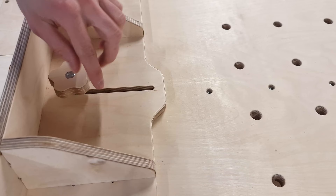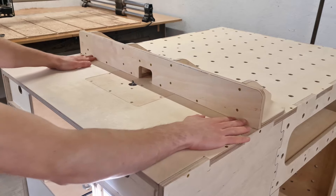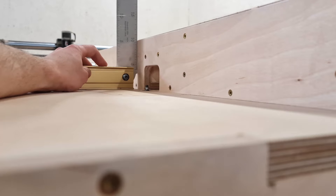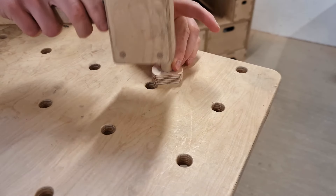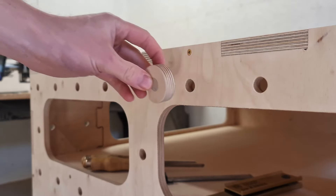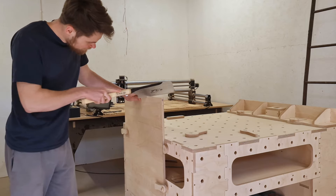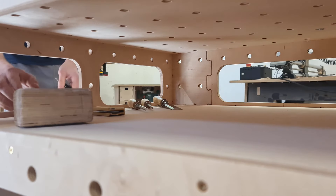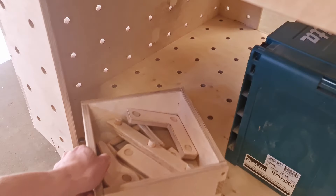To avoid having a T-profile across the workbench I added small holes — you can place the fence above them and secure it with the star knobs. The slot allows you to move the fence a considerable distance and the five T-nut holes allow you to move the fence further back. As the last task we assemble the workbench attachments — the storage boxes, the cam clamps and different size stoppers. My favorite part is having the dog holes at the side of the workbench, allowing you to secure sheet materials in a more convenient position to work on edges. The large shelf is convenient for storing tools and the large storage compartment under the table is great for storing materials or toolboxes.